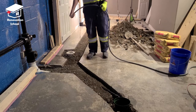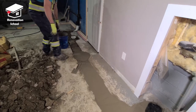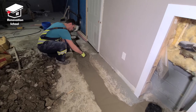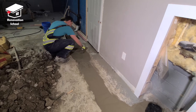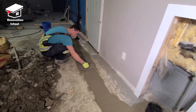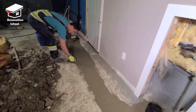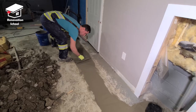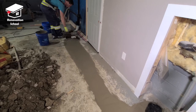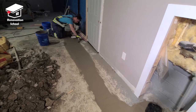Now the rest of the process is fairly easy. Pour the concrete on the surface and use a trowel to move it around. A trowel makes life a lot easier and gives you that extra beautiful finish — I highly recommend it. Go over the surface a few times; you have about an hour to work with it, so take your time and make sure everything is nice, level, and perfect with the rest of the concrete slab.